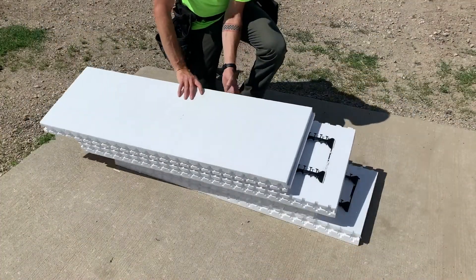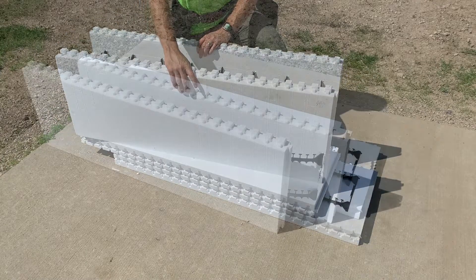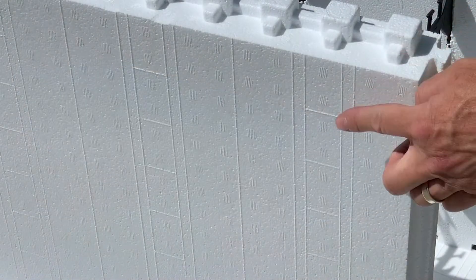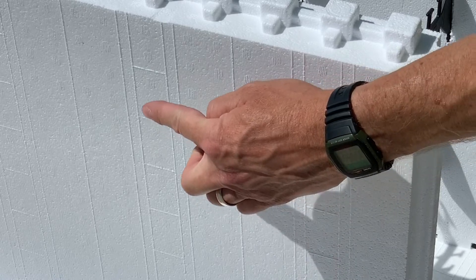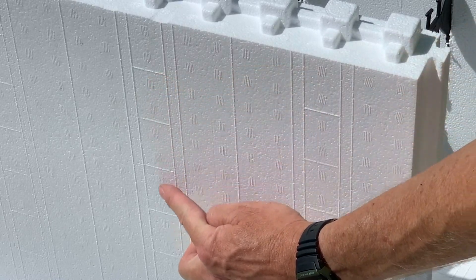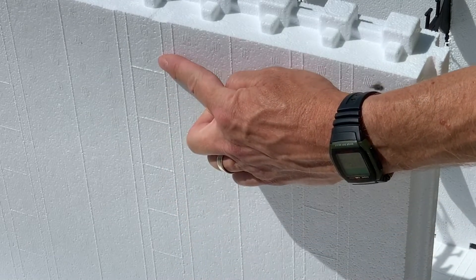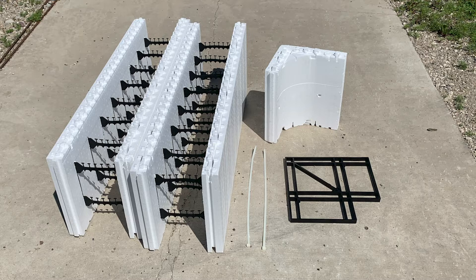The basic parts of your Lightform ICF inventory include these folded, pre-assembled blocks. They're installed with the male castellations on top. Each block has reference marks every 2 inches and a special mark every 6 inches to show where a concealed furring strip and spacer tie is located. 90-degree corner blocks are used to form 90-degree corners within the project. The design may be different for other wall widths.